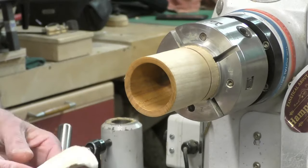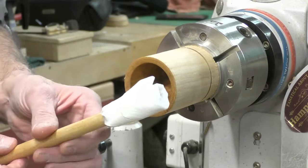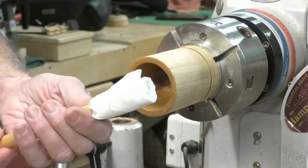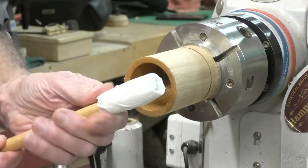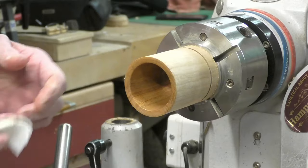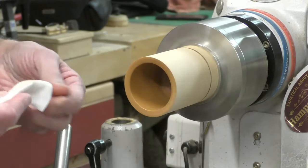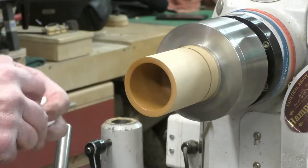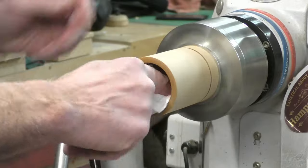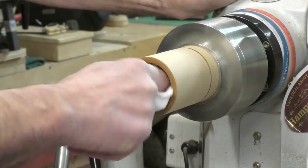Now, if you're not happy with using your fingers in the box, same situation with the sanding, you can just wrap a bit of paper towel around your dowel, use a bit of my ever famous masking tape to just attach it, and you can use that and change the towel on there as you need to. So again, starting with the lathe at about 500, start to just work the True Grit in to your piece.